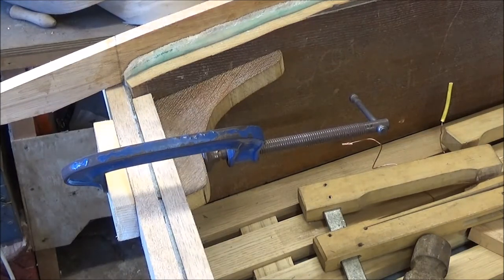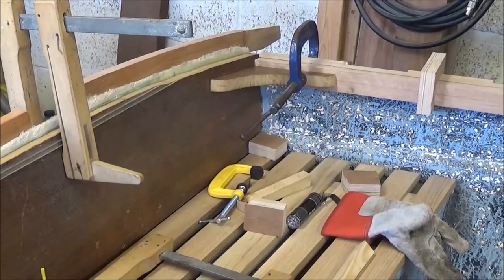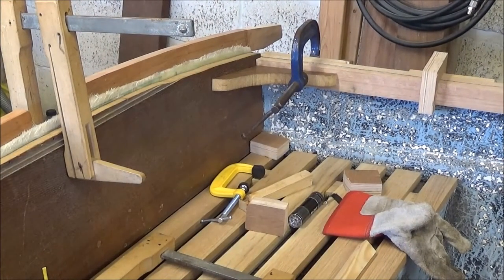because there's no right angles in that at all. The back leans back, the sides lean out, and of course it's more than 90 degrees in the corner, and they've fitted really well together. It didn't take nearly as long as I thought it was going to, because of all the different angles and trying and planing, trying and planing, and I've got them to a point where I think they look nice and sit nicely, because obviously they're pointing up slightly so that they match in with the curve of the transom top when it's done. And I think they're thick enough.